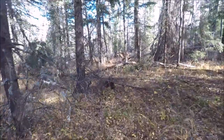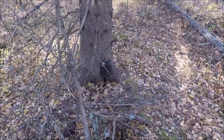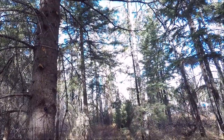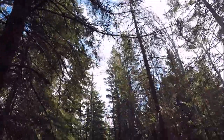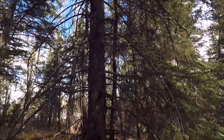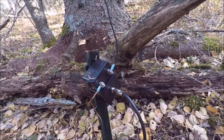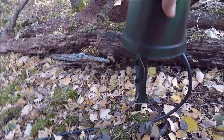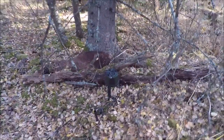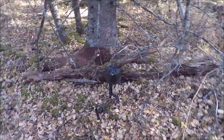From here there are four individual coax lines buried through the bush, going to each feed point or beginning of a beverage. This one here is the northwest beverage feed point, with a little flower pot covering the box. We're going to walk the east line — the wire is tied off to a tree, insulated with an insulator, and number 14 wire travels down to the feed box. The RG6 coax comes in and the feed box is tied to a steel fence post just to hold it in place. I have two ground rods, and based on my frequency sweeps it seems to be an adequate ground system.